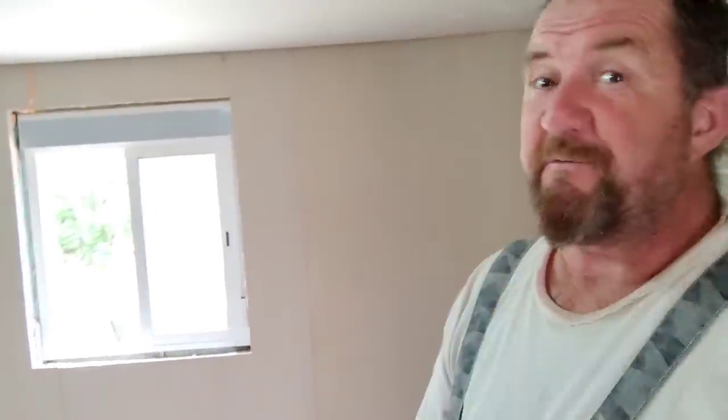You can also get just plain plasterboard and you can do exactly the same stuff, but with that, the foam that you stick it on with will also be a little bit of an insulating layer, really. So yeah, win all round. You can't do this on the ceiling, unfortunately, because it all falls down. Not that I've tried it.